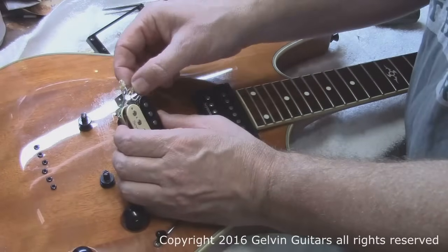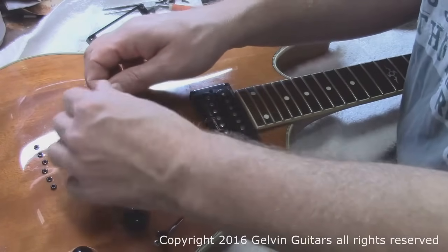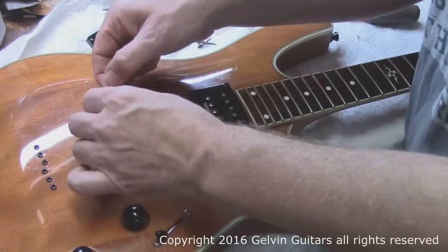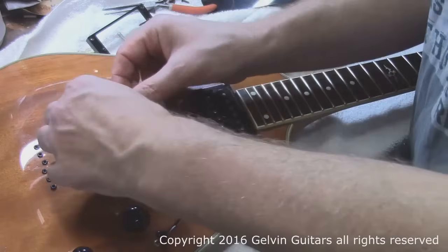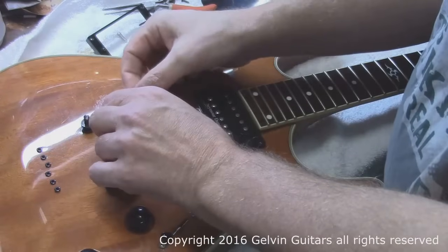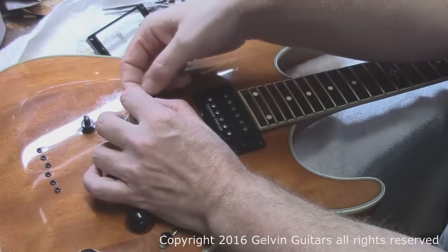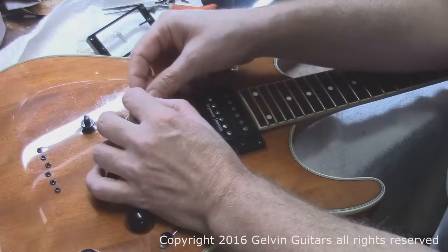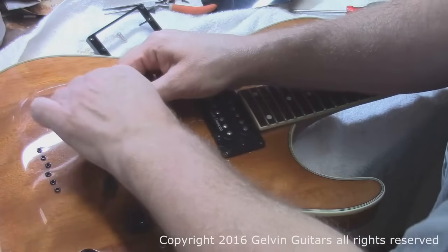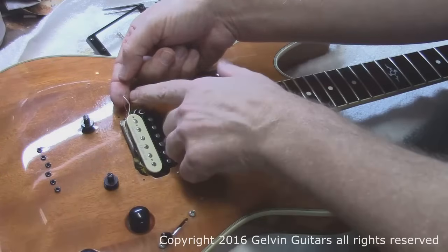So what I want to do is I want to take a look at these, and I want to make sure that these have been taped off well and nothing is touching one another. Okay, this white stuff you see is the wax. There's no reason to wax pot this again after you do this. So these look to be taped okay, but I have to make sure that they've been soldered together well, and they're not breaking apart. And the only way to do that is to remove the tape that's on here and verify. Just like that. Okay, I can tell that's soldered well.